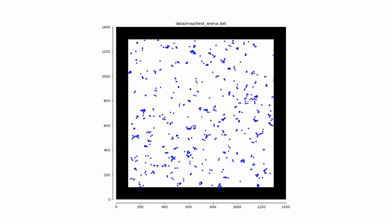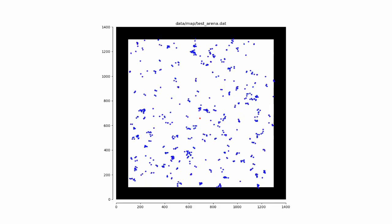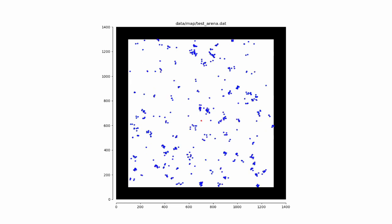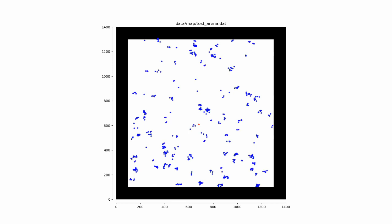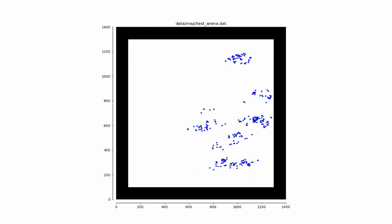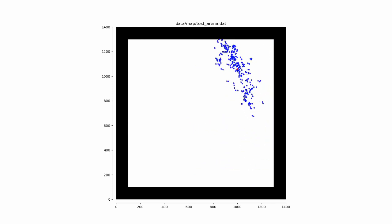So initially we have a model of the arena. We have a mathematical map that has the walls in it, and we fill that with an array of points, and it says each one could be where the robot is, and it may be 1,000 particles. And then every time we move, we go, well, the wheels moved X amount, so I'm going to move each particle that amount, assuming that all of them are our robot.